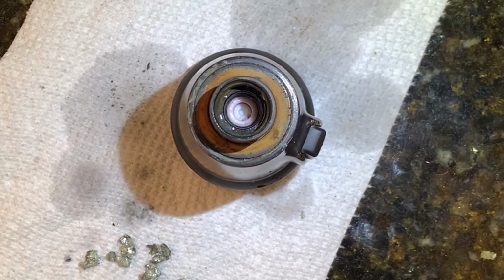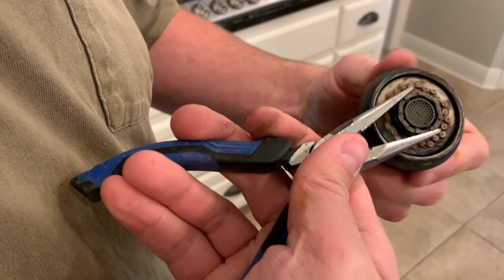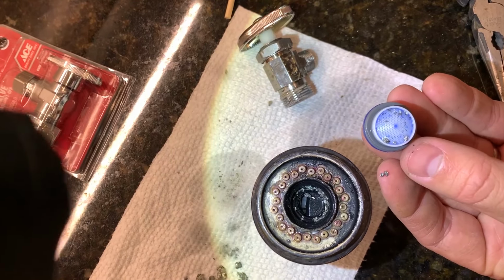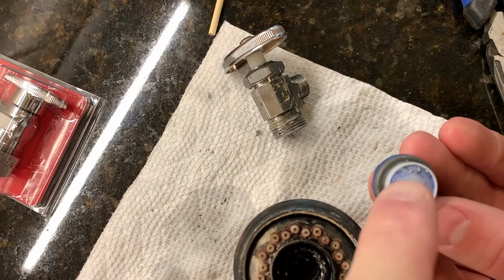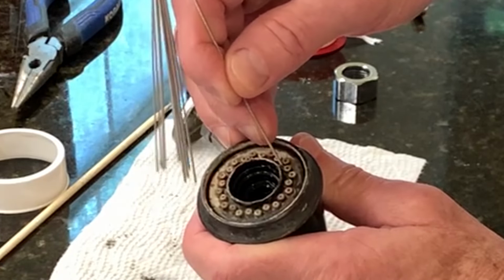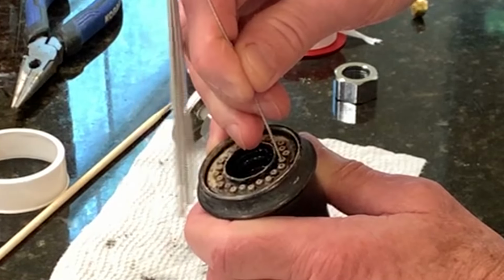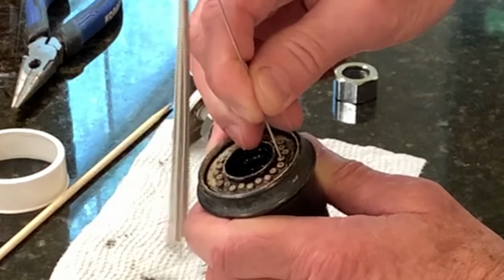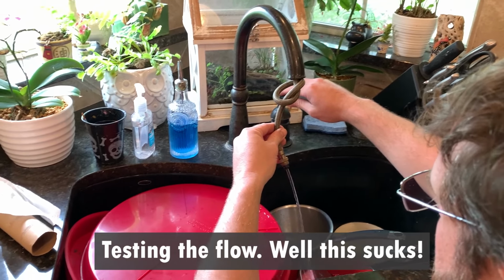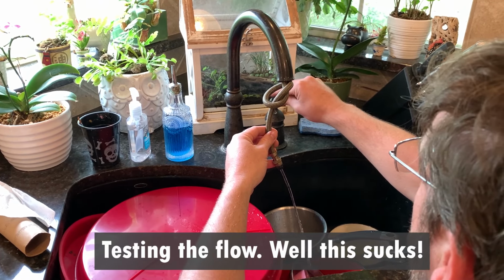We inspected inside the nozzle. We found solder pieces inside of it too, small pieces. So make sure it's not being plugged also. Okay, we're taking this piece off the nozzle. You can see this nozzle is pretty plugged up inside. We're going to clean all that out. There's solder inside the water screen that's inside the nozzle too. Okay, I'm taking a pipe cleaner, going into each one of these nozzle holes and making sure they're open. I'll work my way around, just make sure each one is open. Is that wide open? That's wide open.